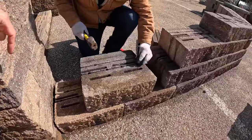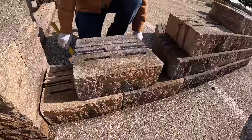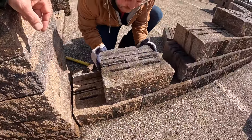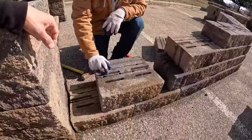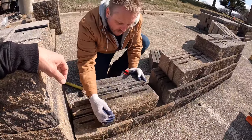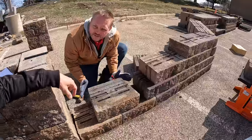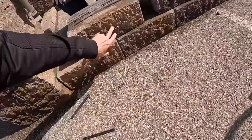We seat the block by tapping it and then push it forward, which locks the block into place. If you don't do it, mother nature will, and she may not be so favorable — she might move it so it's tilted. One myth we're going to dispel: we don't have to maintain a true half bond.